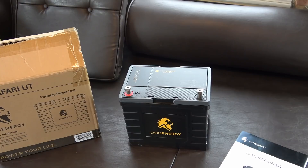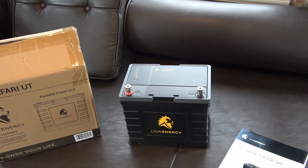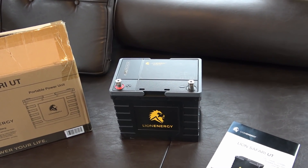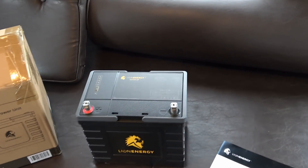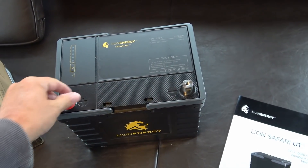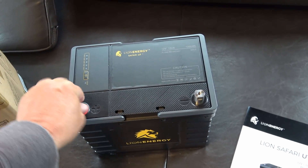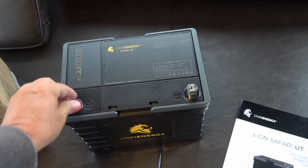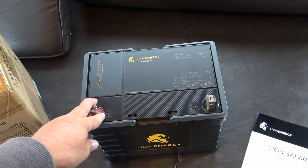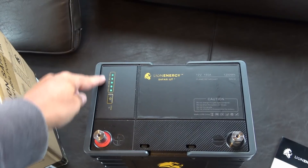It'll hold a charge for two years and it's zero maintenance — there's no maintenance to be done at all. The lithium iron phosphate technology, from what I've been reading up on, is very safe. It's not the type of lithium that's going to be a fire threat. Also, being self-contained plug-and-play, you'll see a lot of videos on YouTube with DIY guys building their banks and messing around with what's called a BMS, or battery management system — that's all built into these batteries. It's got low voltage protection, high voltage protection, and temperature protection if it gets too cold or too hot — everything will shut itself down.